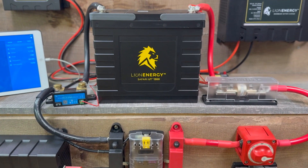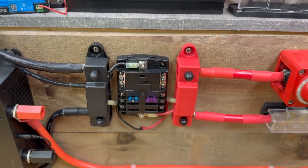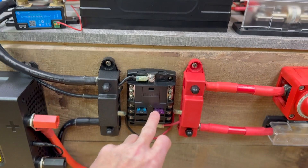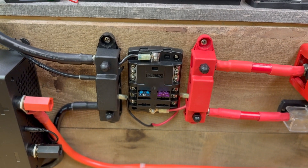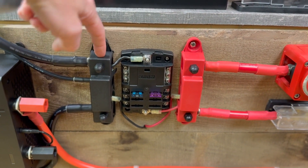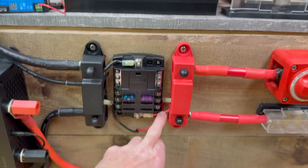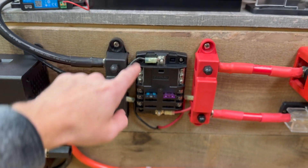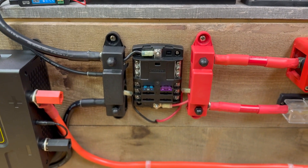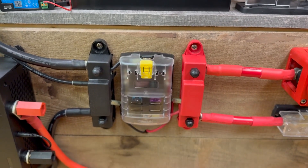In most installations it's not uncommon to have an accessory fuse block, which is what I've installed here. This would be for electronics like a GPS or a VHF radio. All of those can be wired in, and they would have their appropriate fuse protection to ensure that more sensitive devices are adequately protected. Power is taken off the negative bus and the positive bus to power it. The cable supplying the fuse block is sized appropriately to supply any item on it at full load — the sum of all those things together. A nice Blue Sea Systems accessory fuse block.